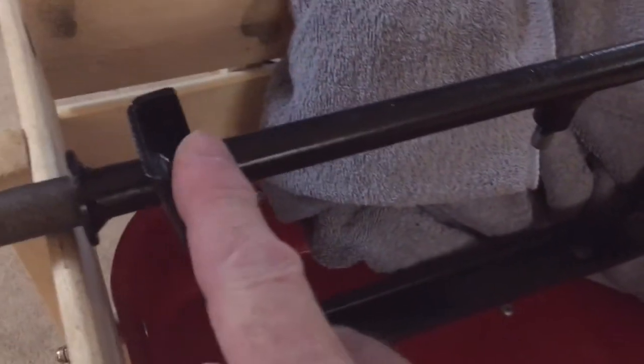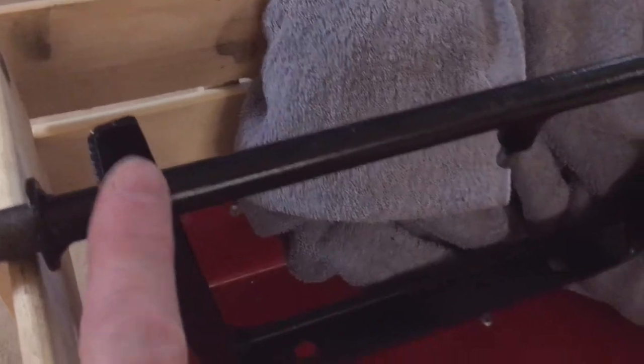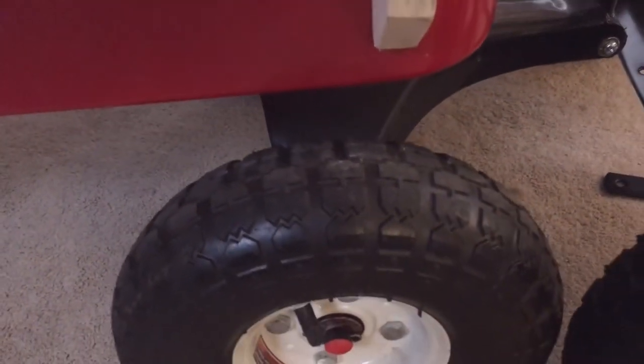The rear suspension bracket is also much beefier than the red wagon suspension. The red wagon has two outboard struts with outboard screws going through the base of the wagon, where the new one just has one going to the center. So I'm going to have to see how I can reinforce that in the rear. I definitely want to use the rear piece because it's much beefier and it's wider. I can easily locate where that rear suspension is going to go by reusing the existing hole locations. They don't exactly match up with the holes on the new suspension, but they'll go outboard a little bit and serve as a reference point. I can move it forward and aft as needed.